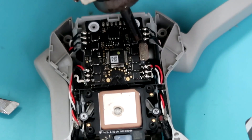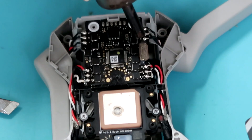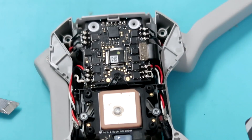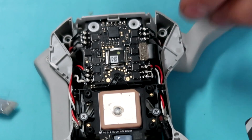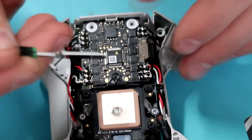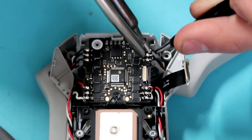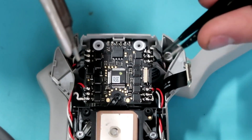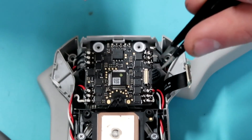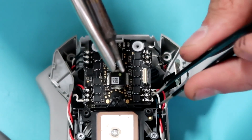There's a little ribbon cable on the 4-in-1 ESC that you're going to want to remove, and it is held down with some pretty firm glue — unlike any other I've seen from DJI. What I did was use a hot air gun to loosen that glue up, and it just popped right off. I'd recommend maybe using a hair dryer to get that loosened. Here we're going to start desoldering the wires — these are very small pads, so if you don't have much soldering experience, just take your time and be careful.